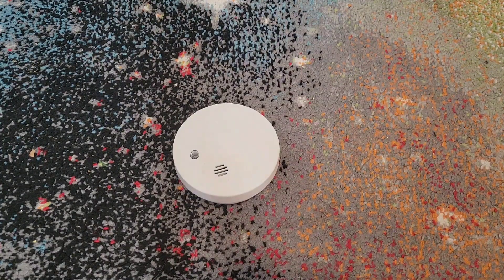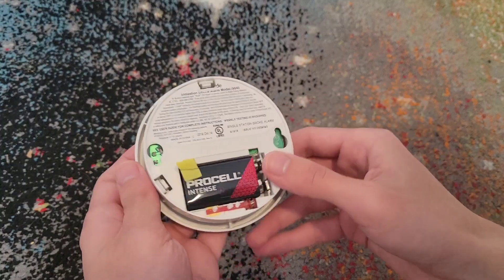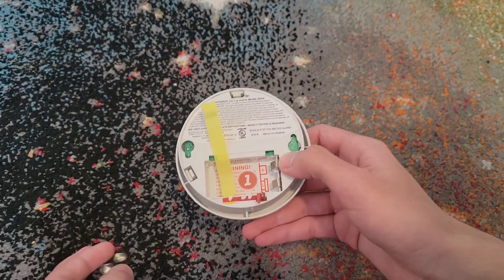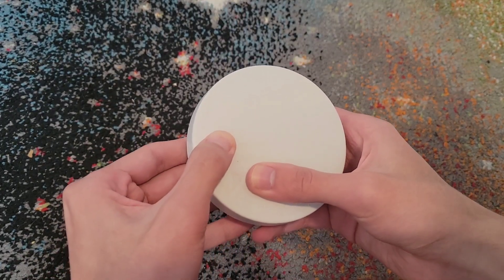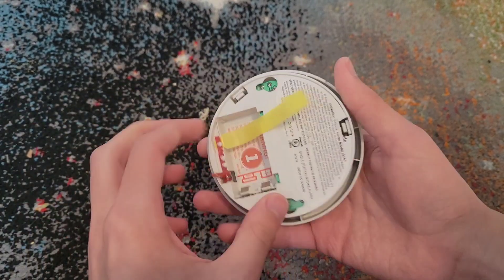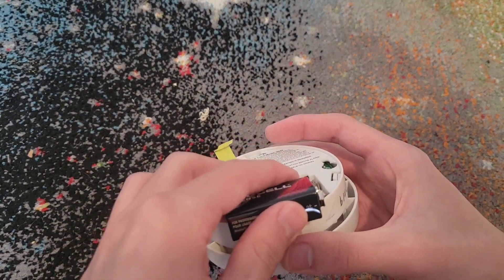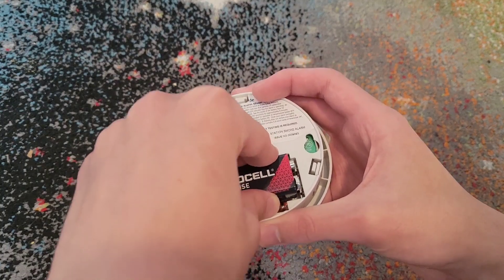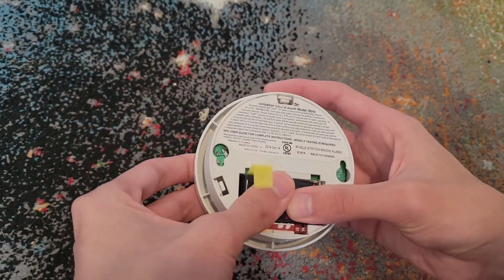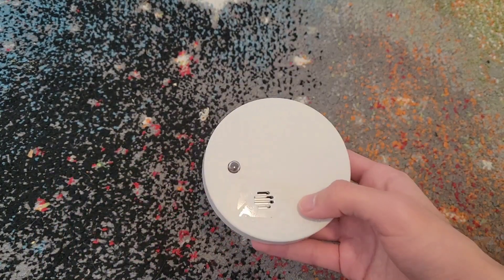Here is a very common model — I've had this one for a while now, and changing the battery is the easiest thing in this one. It takes a 9-volt. You'll have to pull this out any way you want. Hold down the test button until the battery's been drained out. Then get your new battery and slide it in. It's very similar to the other alarms I just covered. You have to push this battery flag back down, push the battery in, and then you can hear it chirp. And it's on.